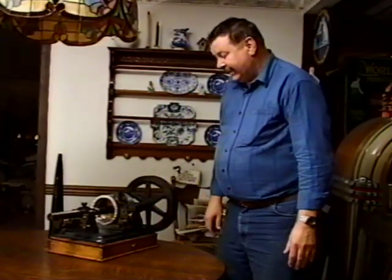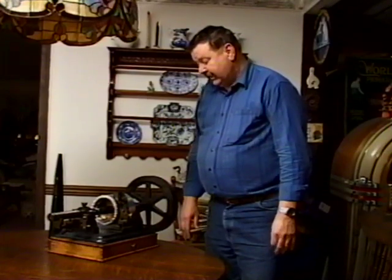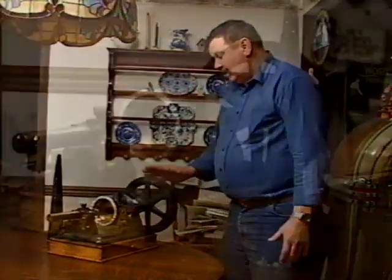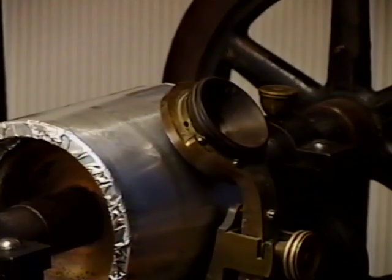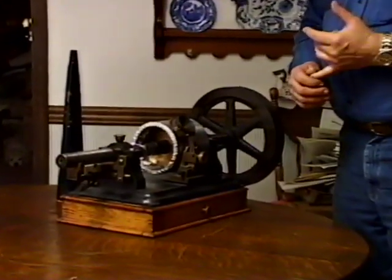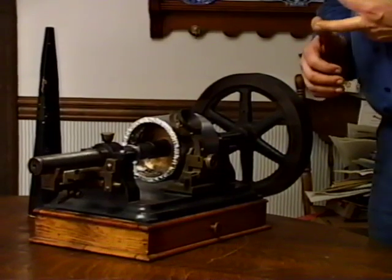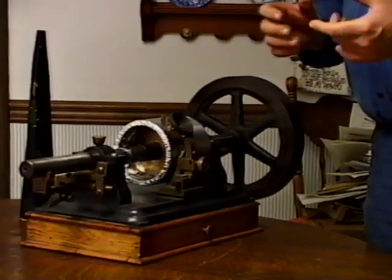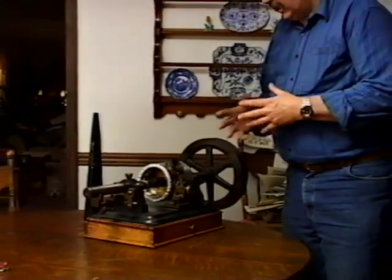This particular phonograph was invented by Edison in 1877. By 1878, he was producing them to be sold and used as demonstrations throughout the United States. This one was made by Bergman and sold to a gentleman in Pittsburgh, Pennsylvania, which I bought from another gentleman in Manor, Pennsylvania. The only differences I made: one, I changed the lead foil to tinfoil using heavy-duty Reynolds wrap because lead foil is very hard to find. Two, I changed the stylus. The early styluses on the tinfoil talking machines were made out of highly polished steel; I changed it to a sapphire. And the diaphragm was made out of very thin metal, and I changed that to mica, which gives it more flexibility. Just those little differences help me record.